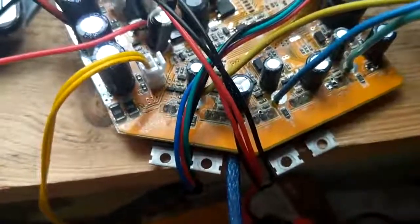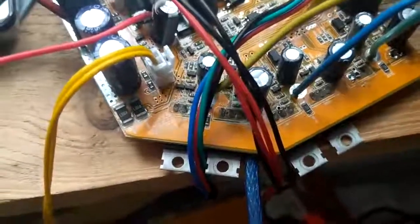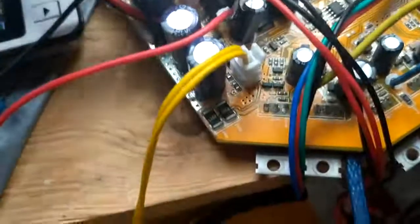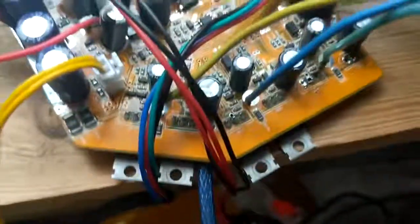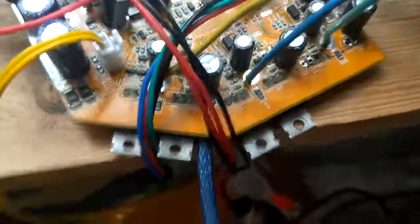It's looking good that I can solder in some new MOSFETs. I might be willing to replace all of these MOSFETs if I can get ones with a better rating - specifically a lower RDS on-resistance.